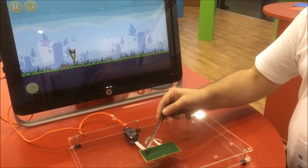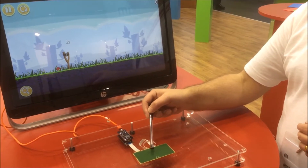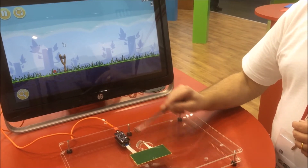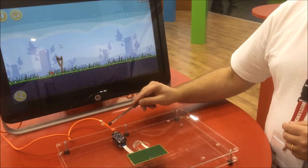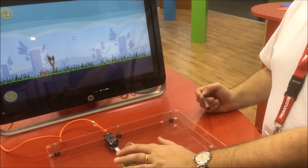This here is a touchpad or trackpad such as you would find on a laptop PC. It has an I2C interface and our FT260 is able to talk to this device. It is using HID over I2C protocol, which our device will understand and transfer over USB to move the pointer on the display.